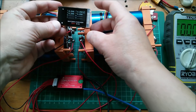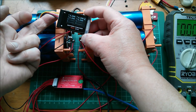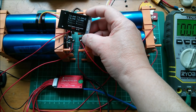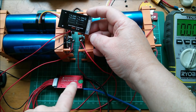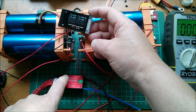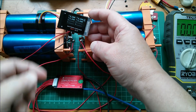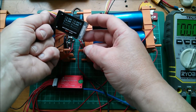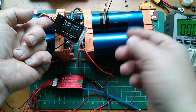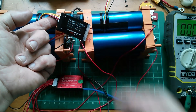Excellent. I put a little battery checker on these four cells with the five-way balance lead. They're all 3.34V. I don't think that's by virtue of the brilliance of the balancing circuit in the BMS — I think they've just settled to that. What I really need is a five-plus-four-way connector to a nine-way, so I can see all the cell voltages on this little checker.